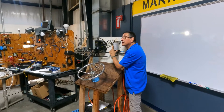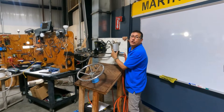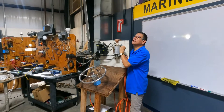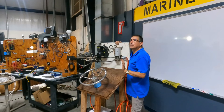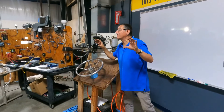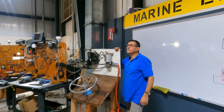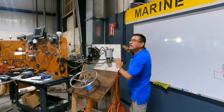If my oil level is low, it's because I have a leak of oil, and of course the pressure decreases. The function of this air fitting is to keep the pressure at 25–30 PSI. This is why in the majority of boats at the transom you have a bicycle pump — it's to keep the pressure. You pump to 25 PSI, tighten, and done.